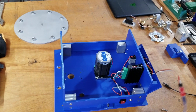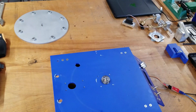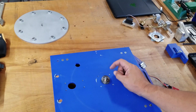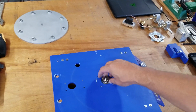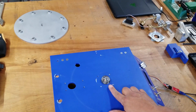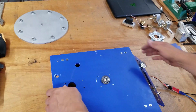Let's talk about how the motor is connected to the plate. This is a coupler I had bought — I had to drill and tap it for my hole size and screw size. It's a 10-millimeter coupler and it's just slipped over the stepper motor shaft, using the set screws already in the sides. I made the hole big enough so the whole thing can come out, but I'll leave it there.